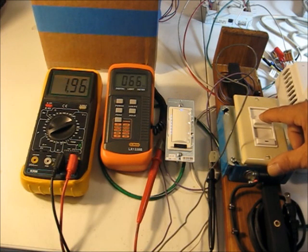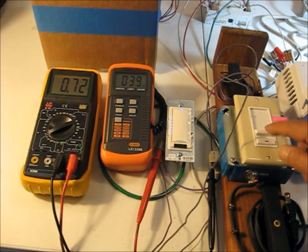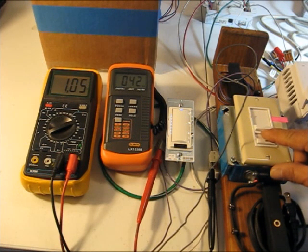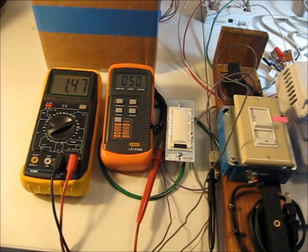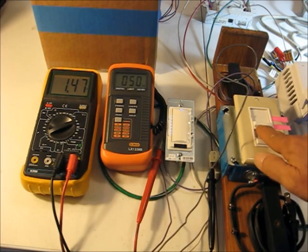Then let's take it down near the bottom. And 86, 60, 50. I'm all the way up there. 39 or 40 is as far as it goes down, so that's only 10 foot candles out of about 1,000 right there. So we'll go and do what we did with the other switch, and we will put the thing at about 50 foot candles, okay, which is a difference of 10 up, which would be 1/100th of the 1,000 foot candles at max.